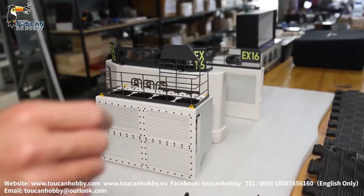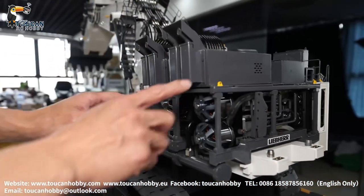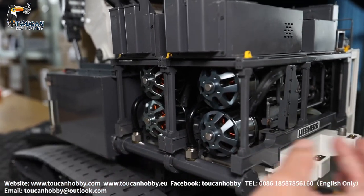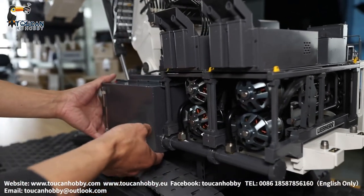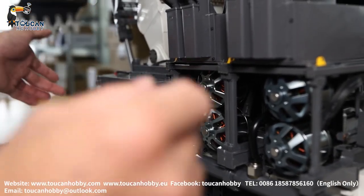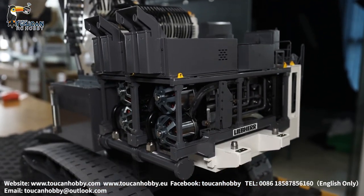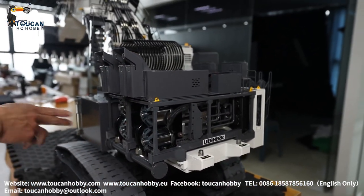All this side cover is hooked onto the main body. This main body has modules — one module with two pumps, and another module with another two pumps — all secured to the main frame. The oil tank is also fitted to the main frame. When lifting, it is only on the main frame, chassis, track, and arm — not on the body.